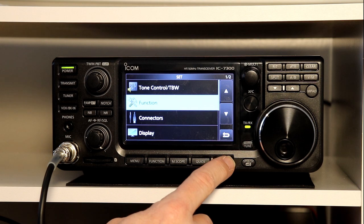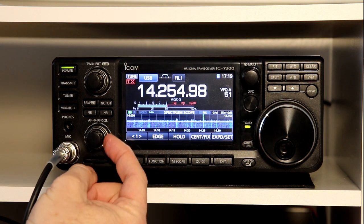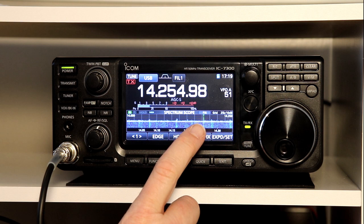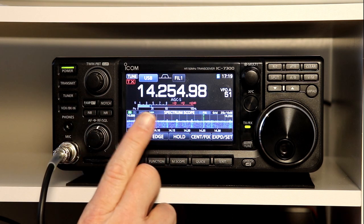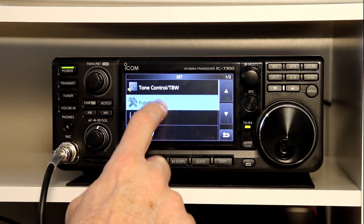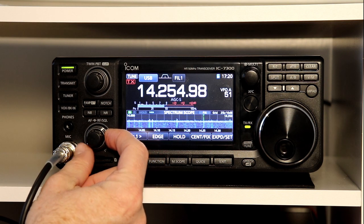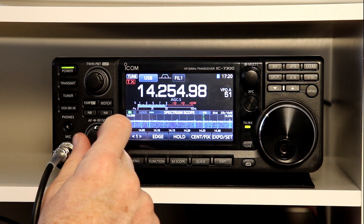And then the one other option they give you is auto. In the auto mode, it operates just as RF gain — all the way up, gain is all the way up, and then as I turn it down, the RF gain comes down. If you are in AM and FM modes, it acts only as a squelch control, so it automatically switches modes depending on what mode you're in. Personally, I like the default mode of both RF and squelch, because if I need to squelch the signal, I probably want the RF gain all the way up, and if I need RF gain reduced, I probably want the squelch open. So I like it in the default mode. That's the RF gain and squelch control.